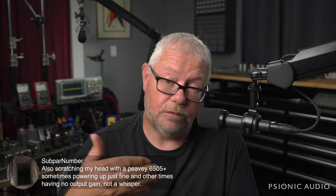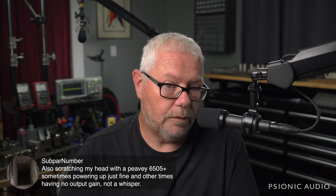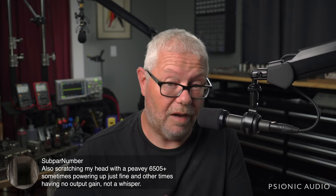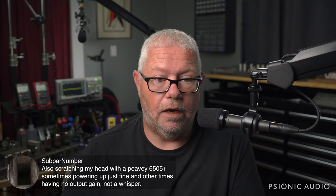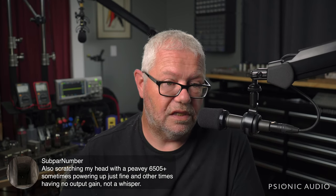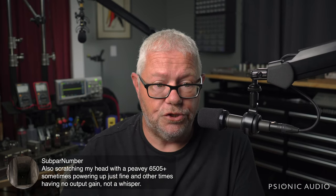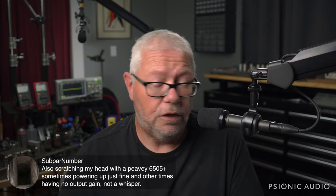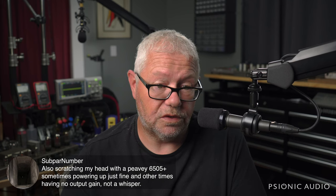And sometimes it'll randomly mute as things get warm or cold. You may be a 75-cent transistor away from a working amp. I can't promise you that, but that's the most common thing for an issue like yours that you're describing in general. Without measuring the voltages in your amp, I can't tell you more than that, though. You could also just have one bad preamp tube that's slightly loose or something.